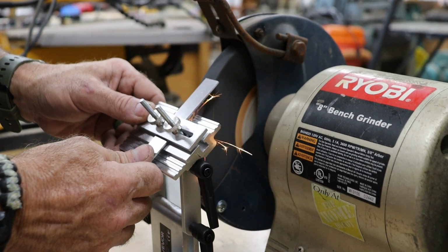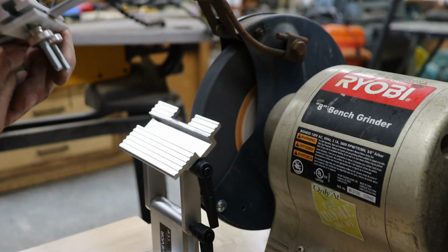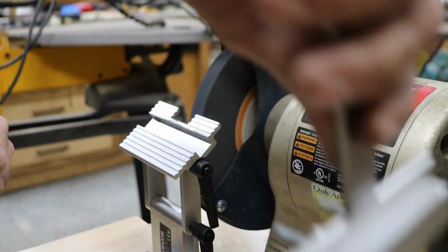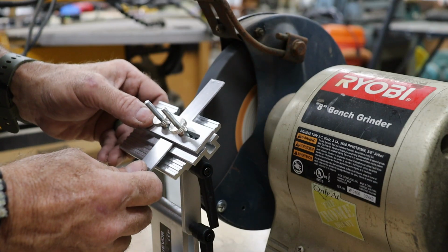All 3 chisels will get a 25-degree bevel. The 1095 steel is soft enough at this stage that forming that bevel is pretty straightforward. You could go old school with a honing guide and some coarse sandpaper, but I've got a bevel jig for my grinder, so I went with the powered route. Faster, cleaner, and a little more dramatic, just the way the supervisor likes it.